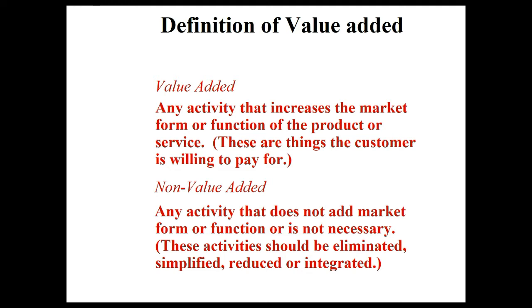Value-added versus non-value-added — it's very important for your team to understand these. For something to be value-added from the customer's perspective, it has to meet three criteria: it must be valued by the customer and something they're willing to pay for; it has to change the form or function of the product; and it must be done right the first time. Changeovers and maintenance don't meet those criteria, so they are non-value-added. We want to minimize or eliminate them.